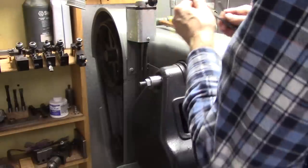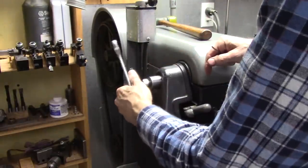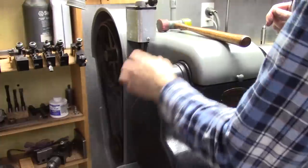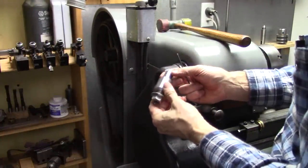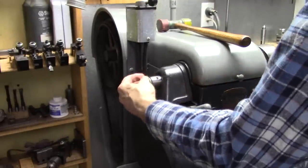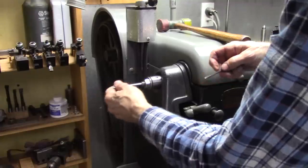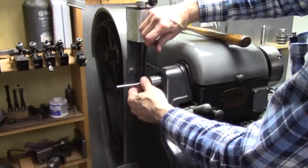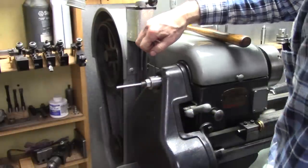When you want to take it out, take your rod out, run the nut out to the end, tap it, and it releases. I've used this thing a bunch of times — usually for making repetitive shaft lengths and finishing the ends of them, or snap ring grooves, repetitive keyway — not keyway — snap ring grooves, things like that.